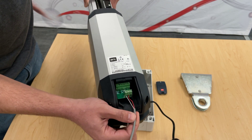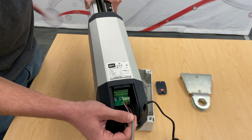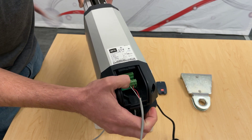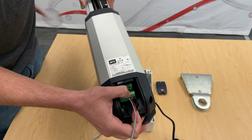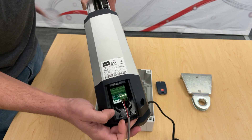This looks a little thin, but this is just a demo. We recommend not using anything thinner than 16-gauge cable. Going by the color combinations: your white goes to number one — that's your limit switch cable; your red, or positive power, goes to number two; and your black, or negative power, goes to number three on the control board.